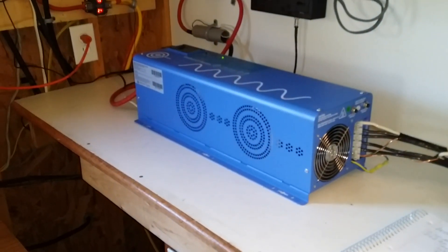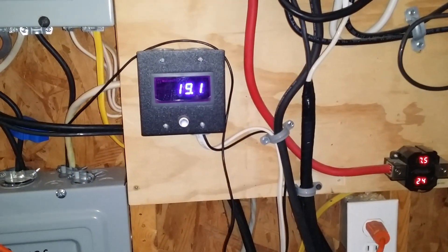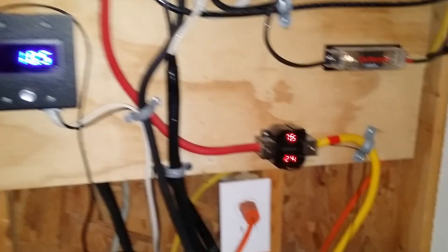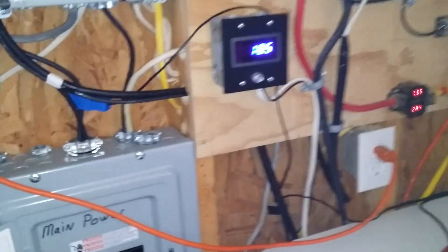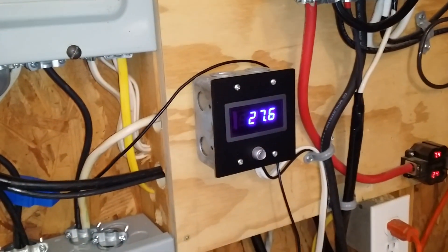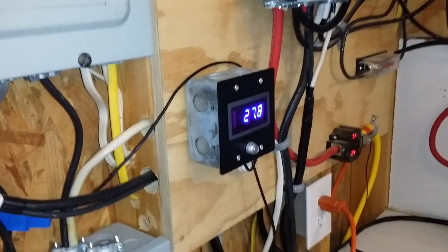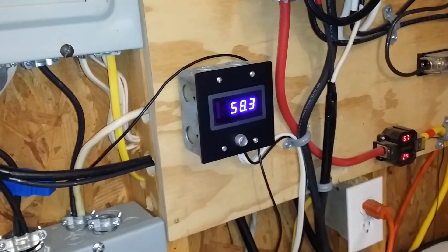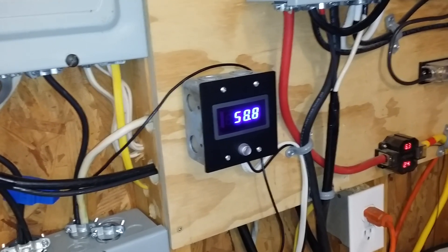Back in the shop — we're pulling about 18 amps right now, so the refrigerator and freezer have cycled off. When they cycle on we're pulling around 25. The sun is now putting in about 7.5 amps into the battery bank. If I turn on all my inside lights, the amps jump up to 27. If I turn on all the outside halogen lights that puts quite a bit of load on and the amps jump up to 58 to 59.